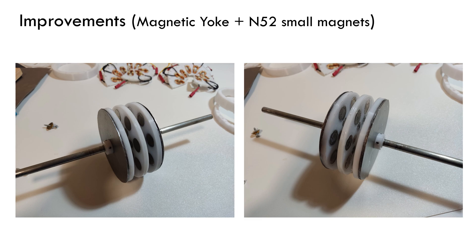Here is the rotor with the disk assembled. At each end, I installed three disks, each 0.7mm thick, made of carbon steel. The increasing weight and moment of inertia of the rotor was quite significant and affected the dynamic response of the machine in terms of acceleration capability, although it gained in performance and efficiency as will be shown later.